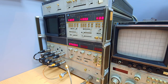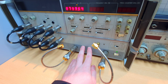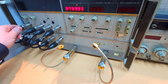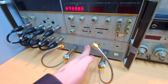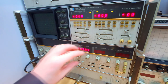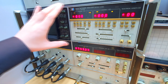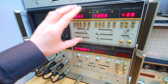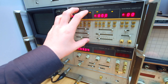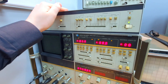This machine has four floors and we need to calibrate it before use. It has an S-parameter test set with two directional bridges and four cables for the RF reference and A and B signals. This is the main measuring device with signal generators, frequency synthesizers, and phase and magnitude detectors. The display unit performs calibration, marker selection, and measuring — it also makes Cartesian to polar transformation in an analog way to show the Smith charts.